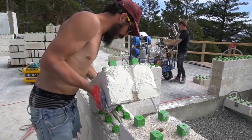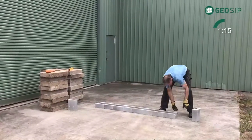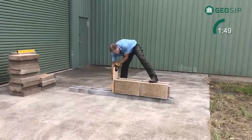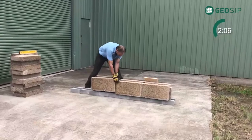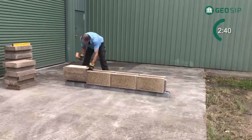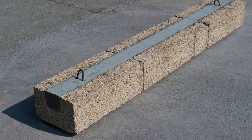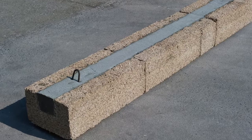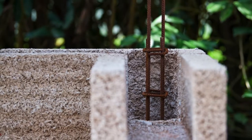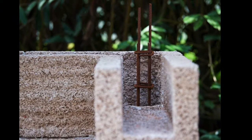Interlocking blocks are another form that hempcrete can be produced in. This form eliminates the need for a full mortar joint between blocks. This method can also be used in conjunction with structural material, which means that the interlocking blocks can be used as a full wall build-up. A disadvantage of this form is that the additional structural material is usually concrete, and concrete is very unsustainable. However, the amount of concrete required is reduced as the hempcrete can provide additional structural assistance.